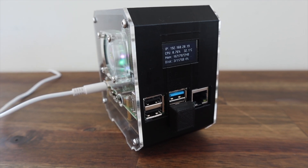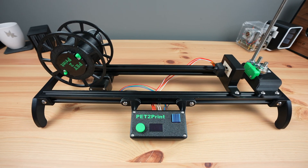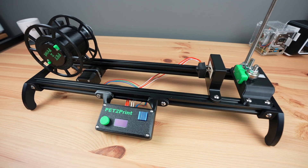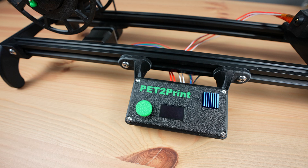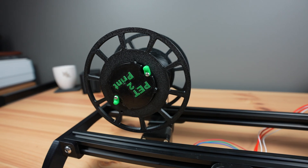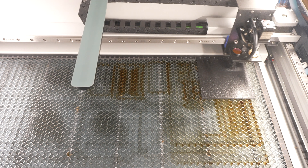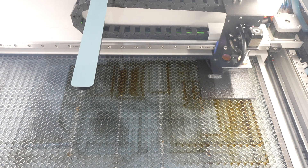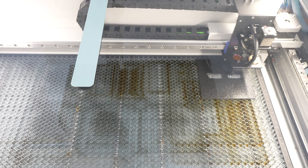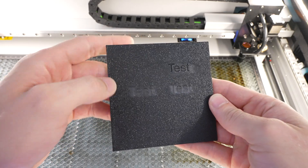With advancements in 3D printing, I can add labels to the enclosure by changing filament colors, but this makes the prints take much longer, and you're quite limited in the detail or clarity of text that this method is able to produce. You can't really produce crisp, readable text smaller than about 8mm. I've experimented with laser engraving onto 3D printed parts in the past with diode and CO2 lasers, but the main issue is that the 3D printed plastic melts rather than being marked or engraved. In some cases you can see the text, but it's because a layer or two of the 3D print has been removed.